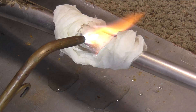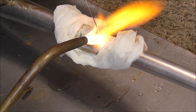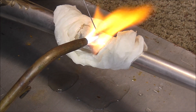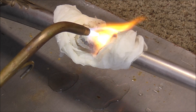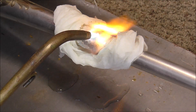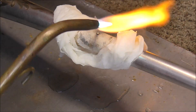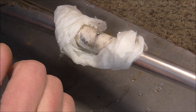I'm going to heat that up to temperature. Solder does not want to flow too well. What's happening is the cloths are sucking up too much of the heat, I think. I may need to move the cloths back a little bit. I think I'm going to need to move them back because it's sucking up too much of the heat — I don't think it's getting hot enough. I'm going to put some more flux on this.